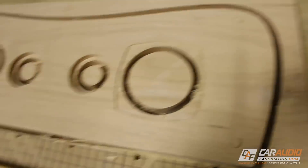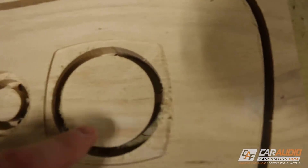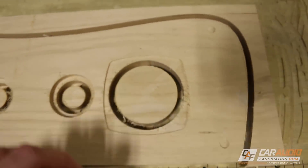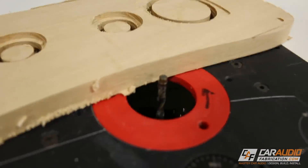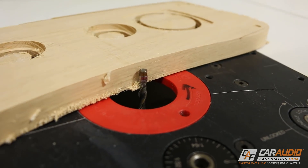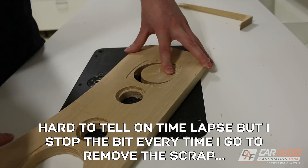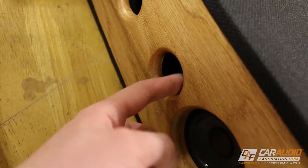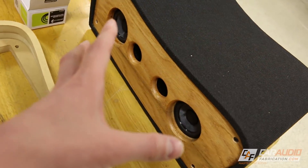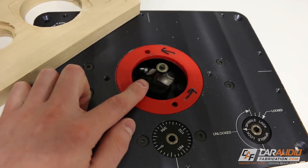Our first cut is now complete. On the insides, in order to prevent that little piece from flying out once it cuts all the way through, the CNC machine leaves these little tabs — but that's something I have to deal with over at the router. I start by popping this off of the template tape, and then over at the router I use a quarter-inch spiral flush trim bit to get rid of each of those tabs. On our finished design, we have a nice round-over edge around each of the speakers and around the port entrance holes. Those round overs give the baffle a nice look and also help avoid port air noise. So I flip the baffle over and use a round-over bit on the front side.